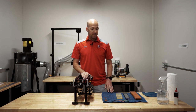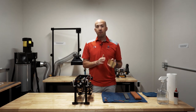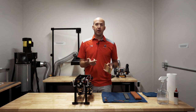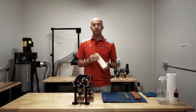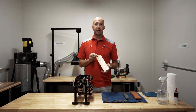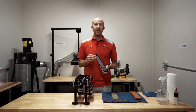Now that we have our blades mounted in our jig, it's time to move on to the stones that we're going to be using. Stones come in all different grits. It's important to start with a rougher stone and work your way to the finer stones. If you're not quite sure of what grits you have, talk to the dealer that you bought it from, or take a quick look online. With diamond stones, you'll generally see black will be extremely coarse, then you can move to a blue which is finer, a red which is even finer, and then a green which is the finest. Those are the colors for DMT. With other stones like Frank's signature, they move from black to blue to red to gold being the finest step.